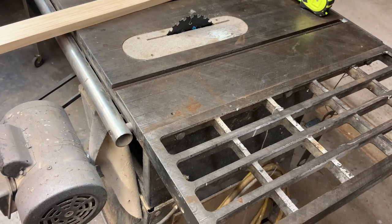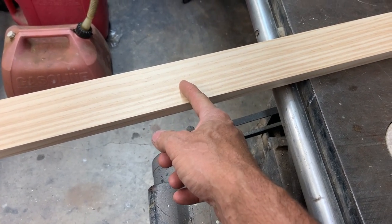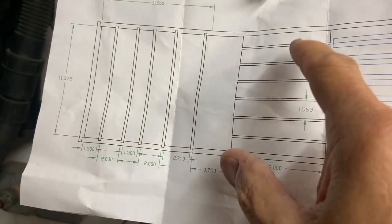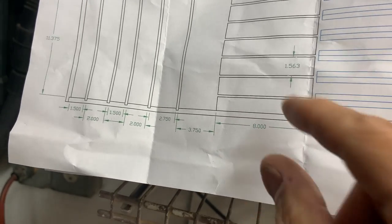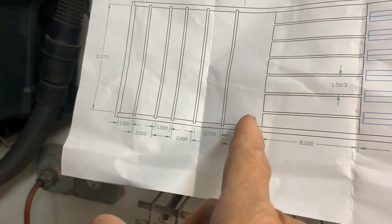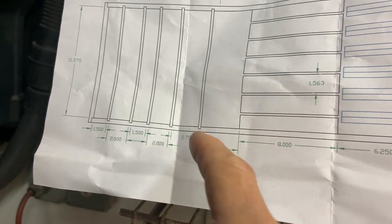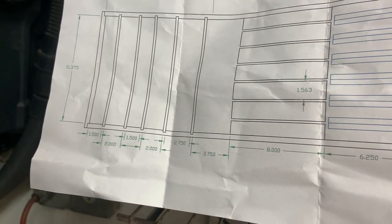Once we rip that piece off, we're going to cross cut this into a little over 8-inch long pieces. We need 14 pieces that are eight inches long to glue together to make these blocks so the knife can sit in the groove between them. I had a piece on the end here that I removed from my drawing — I think I'm just going to leave those ends open. The knives don't go long enough to come into that space. I know it might be a little weird having those unfinished ends, but I'm going with it.